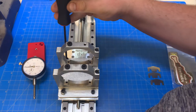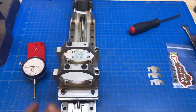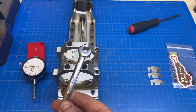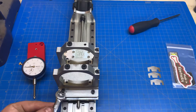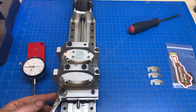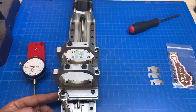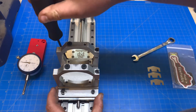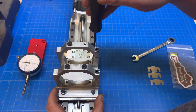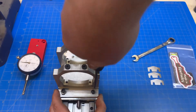Once you have all of these screws started in place, you're going to make sure that you're fairly square. If you're not square, you're going to take a 10mm wrench and turn this eccentric nut. You can actually go ahead and familiarize yourself with the adjustment system before you get it mounted to your machine. But once I'm pretty comfortable with it square, we're going to tighten all of the screws, doing the eccentric nut last. That's going to make sure that it doesn't move on us.